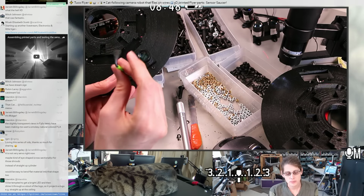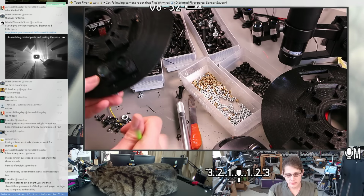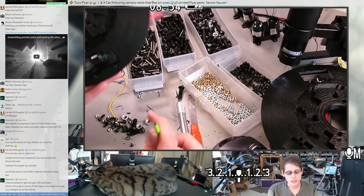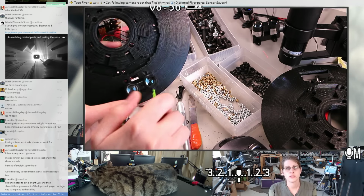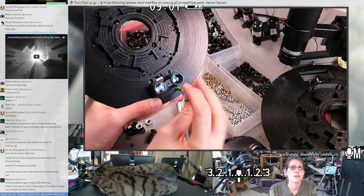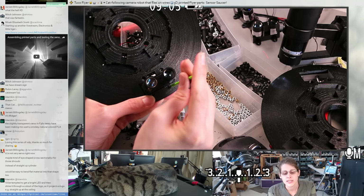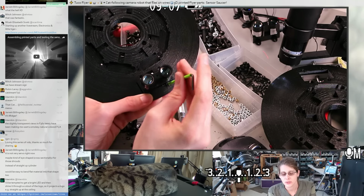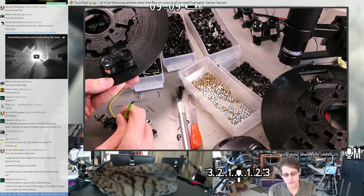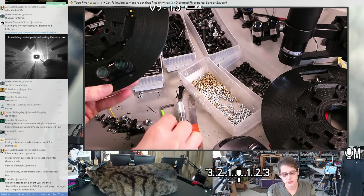But then on the top, I want some LEDs kind of as navigation lights. Those won't really be visible from most of the shop. I'll be able to see them from the loft area. But mostly what I want those for is the overhead camera view that'll be like the mini-map. And for that, I just want points of light that'll be easy for humans and computers to detect. So for that, I'll probably use some lower density LED strip with no diffusion over it.